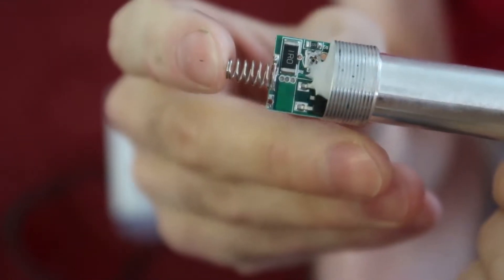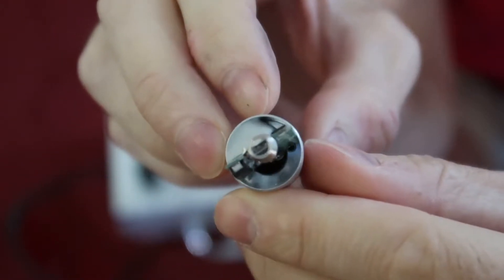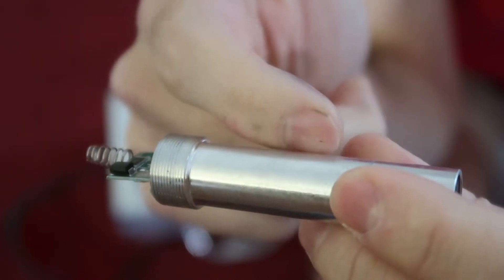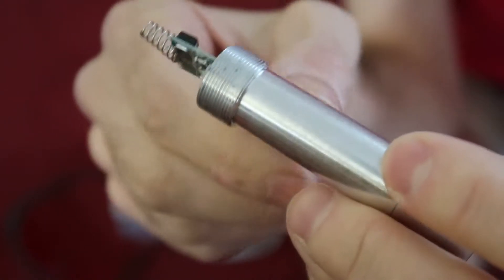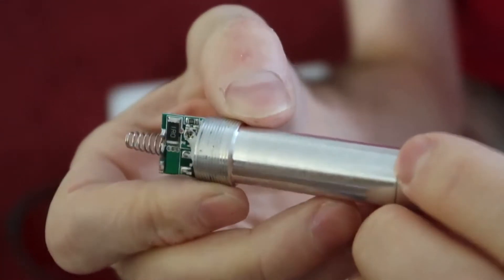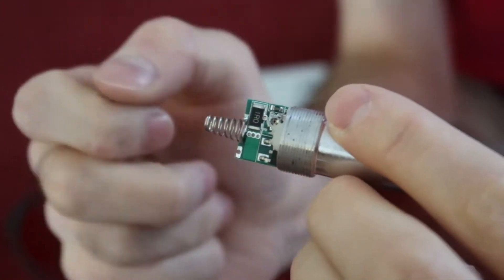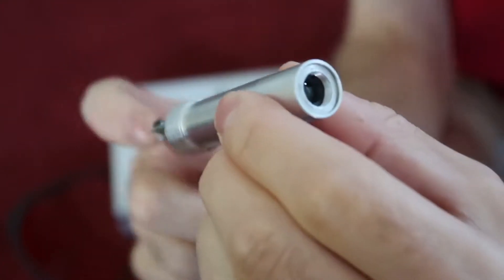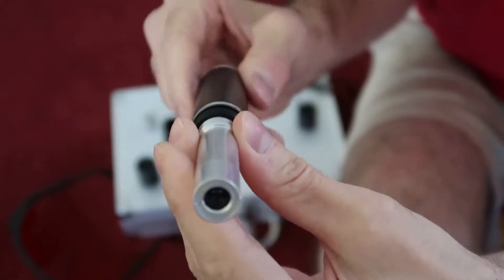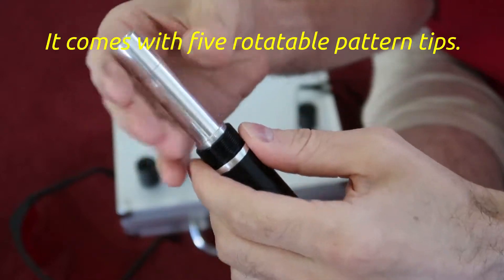Here's the tip of the laser — the part on the spring that pushes in and out. It's kind of clumsy but it works. There's the circuit board and the adhesive compound used to hold it in. I haven't tried removing the laser diode yet, but I suspect it may just be pressed against a piece of metal and may not be in good thermal contact either. There's also that adjustment trimmer I might use to turn the intensity down to save battery life and laser life. Then we'll put this back together — the tips are a lot of fun and I can't wait to show you those.